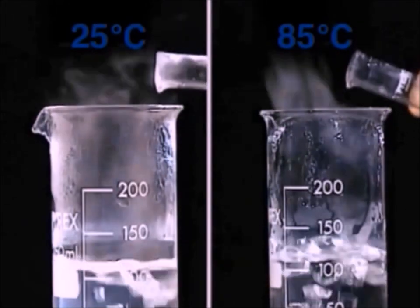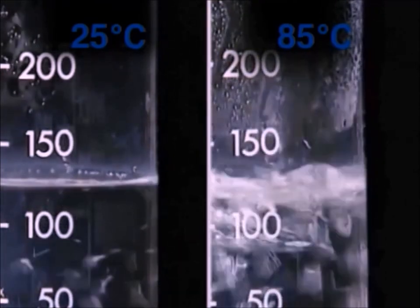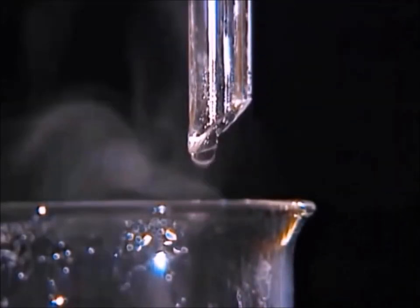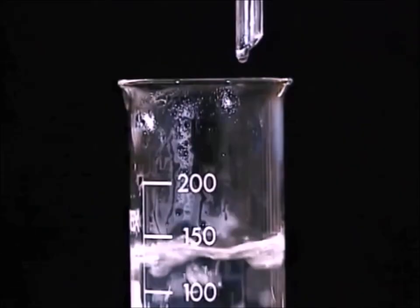Now think about that. Are you going uphill? Do you need more water or more steam? You've got to think about that because that is the biggest, most important aspect. Because if you're out of water, who cares about the steam? You're going to slow down — put some water in. Now, if you can put some warm water in, it starts right back bubbling right away. So injector, feed water, positive pump — if you can put a little bit of water in at a time, it doesn't even affect anything. Think ahead putting your water in, and then you can be a great fireman.